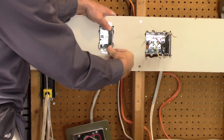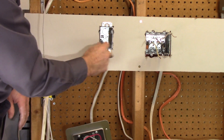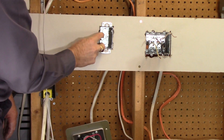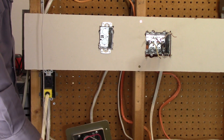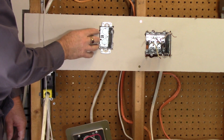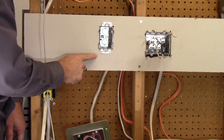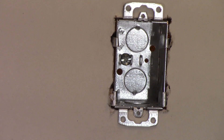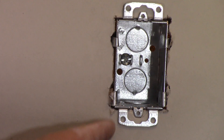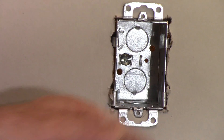It's very difficult to push that box in without losing your brackets, but you can see them on the outside of the box grabbing onto the drywall behind. Push the box in tight and bend the tabs back inside the box. Of course you don't have access to the back like I do, so these are not an easy bracket to work with — but there it is installed, tabs bent in nice. The box is firmly installed in the drywall.